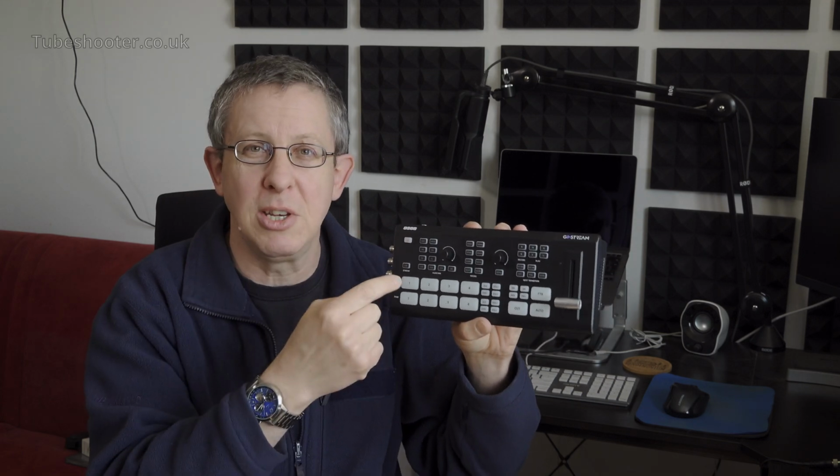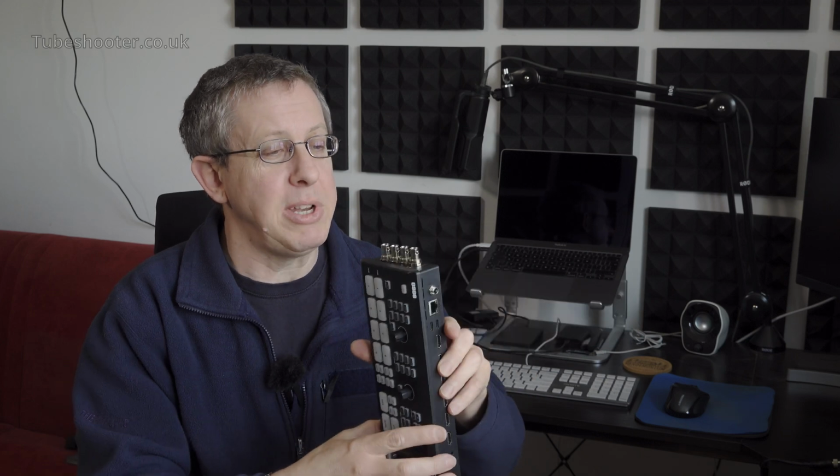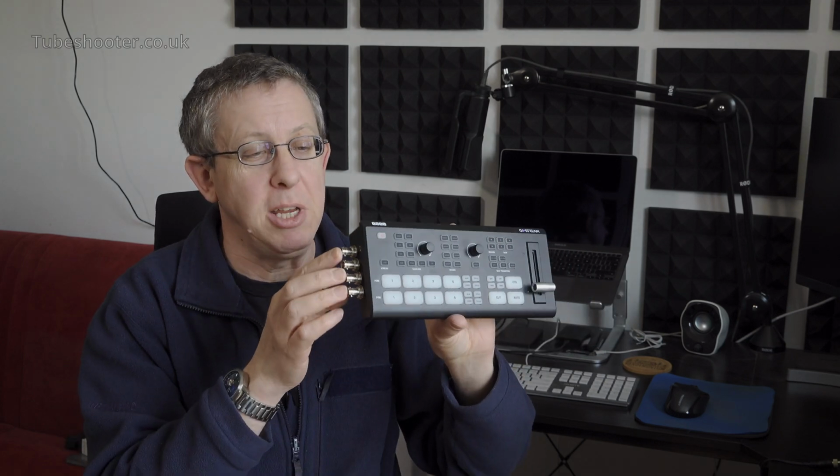with the caveat that if you switch the live channel from HDMI to SDI, there will be a little glitch. So that's the one thing you wouldn't be able to do, is if you wanted to go from channel 1's HDMI to channel 1's SDI, you'd need to cut away to something else and then cut back, having changed it. But it is pretty impressive, I think, to have the flexibility of the 4 SDI and the 4 HDMI all in one pack.